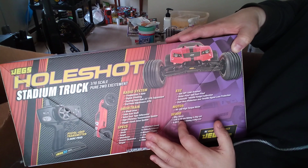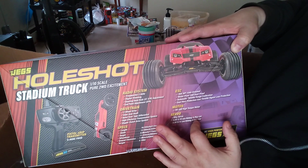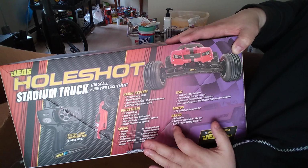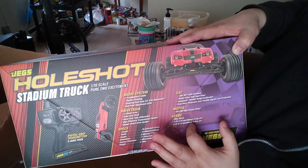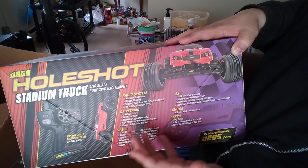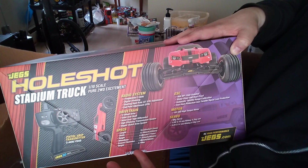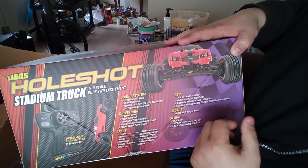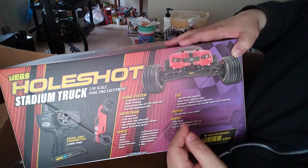At 4.8 volts, the servo has 0.16 seconds at 4.2 kilograms. At 6 volts, it's 0.14 seconds at 6.5 kilograms. So I would assume it's over 7 with the 7.4 going through it, of course. If I'm wrong, how does that work, or does it only separate the 7.4 and make only 6 volts going to the servo? But I've heard that the more power you run a car, the higher the torque the servo might get, but I could be wrong about that too.